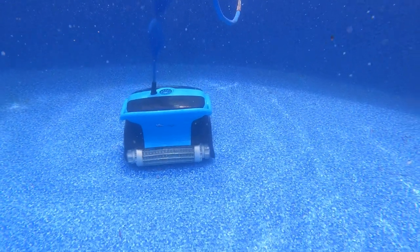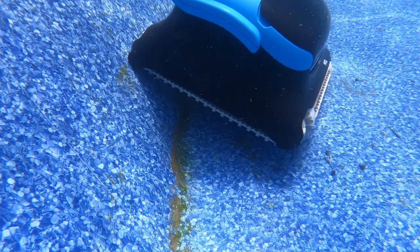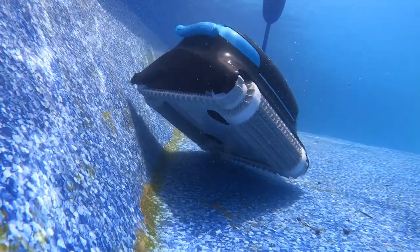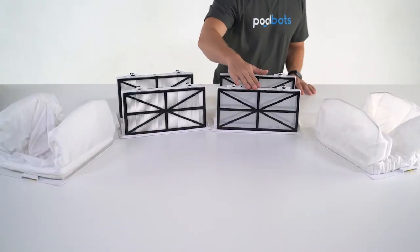It's sad to see neither of these robots come with such a smart and handy feature. Speaking of filters, both bots share the same filter media options. While the dual brushes and anti-tangle swivel may be very nice upgrades, the filter media did not get such an upgrade. Both robots come with the standard fine filter, which does an okay job but will struggle to pick up all the fine dirt, dust, and algae that cloud your pool water, as well as leaves, which will quickly fill the cartridges. Most premium robots competing with the Nautilus CC Plus, such as the Dolphin Quantum and Sigma, include an ultra-fine filter cartridge to solve the cloudy water issue. Upgrade options like the Dolphin Premier can tackle both fine debris and large leaves and twigs thanks to its multimedia filtration, which includes four filter media types, allowing you to truly customize your pool cleaning.